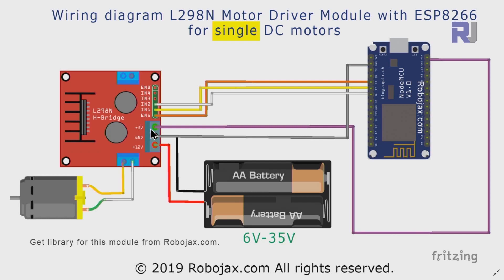The 5V will be connected to VIN if USB is not connected, so remove it when programming and reconnect once done — this avoids current flow issues. Some modules have no diode and current flowing between them can waste resources or heat up and burn your module. For the three pins controlling the motor: Enable A is connected via orange wire to D8, IN1 is connected to D7, and IN2 is connected to D6.